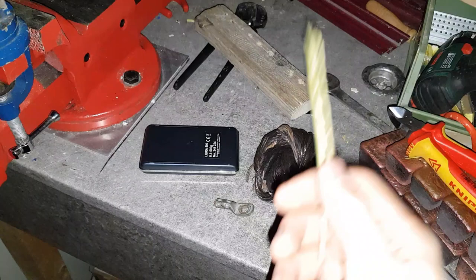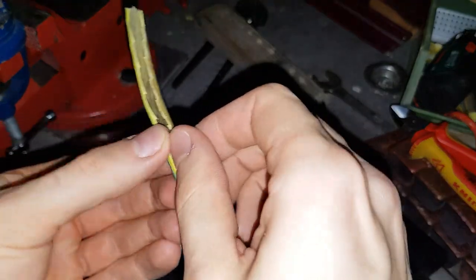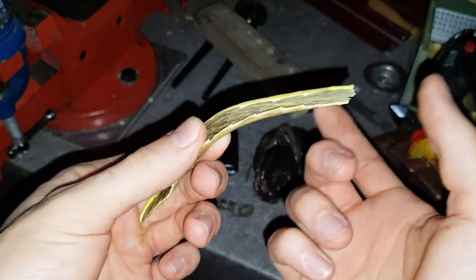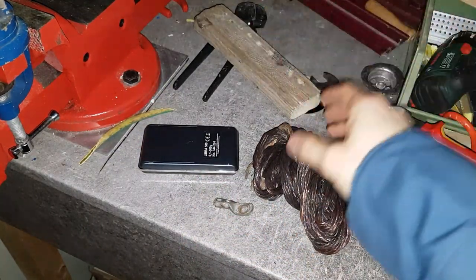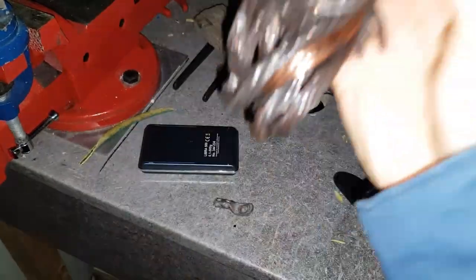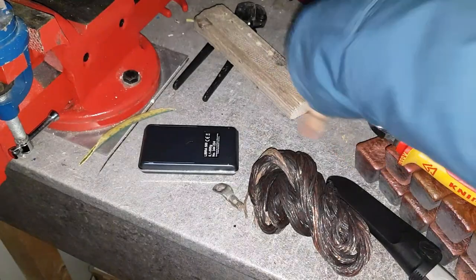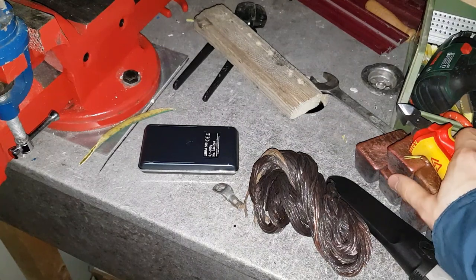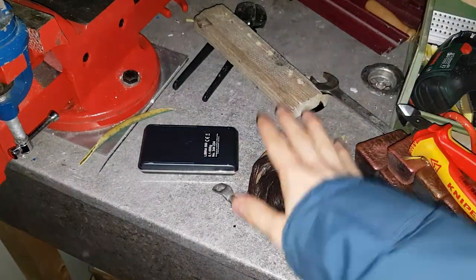The reason why it looks like normal rope and not like copper wire is because it's corroded as heck. This stuff was buried, and you can see when you look inside the insulation — water got in there, probably on a regular basis, and then in connection with some chemicals it really just corroded the stuff pretty well. Copper is a semi-precious metal, so it didn't get heavily corroded, but it's still black now. So this would only go as burnt copper — you cannot sell that as anything else. However, I'm still not planning to do that. I'm gonna melt it down into some pretty bars, because this is still 99.9% pure copper. Burnt copper only has to be at least 95% pure, so it would be kind of stupid to sell it as burnt copper.